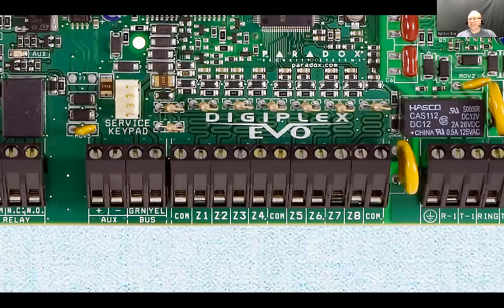And the reason for that is there is something called stay arm. Stay arm is a condition where you're arming the system, and some of the chosen sensors that are programmed for the stay arm condition are going to be armed, and some of the sensors are not going to be armed. Like, for example, if you want to go to sleep and you want to arm your house, but you don't want to cause a false alarm if you wake up in the middle of the night and just want to go to the fridge and have a drink of water. Right?